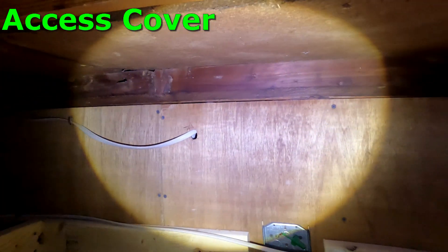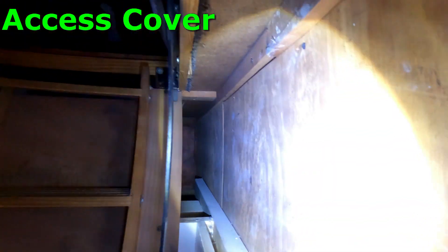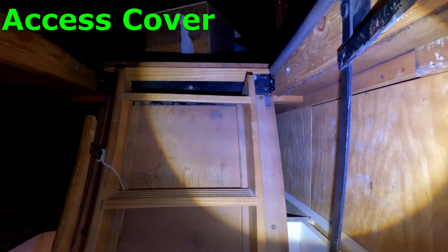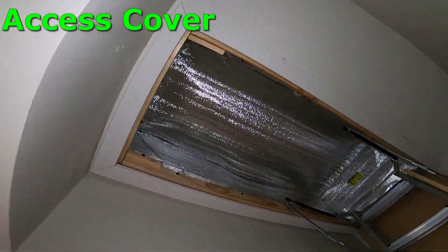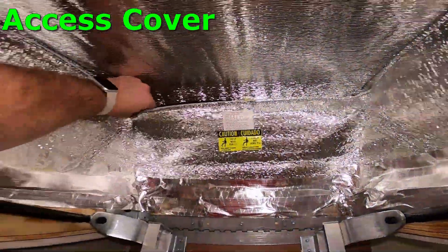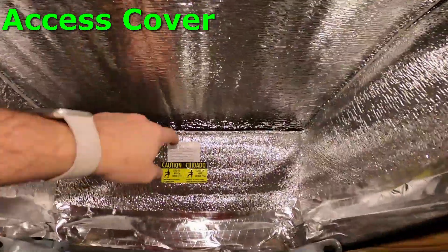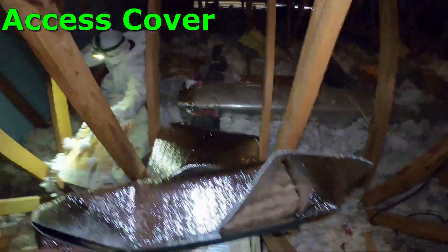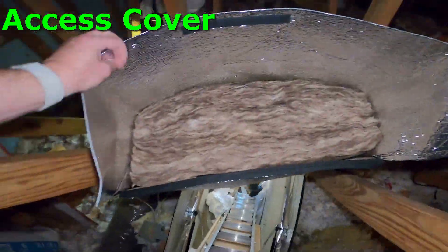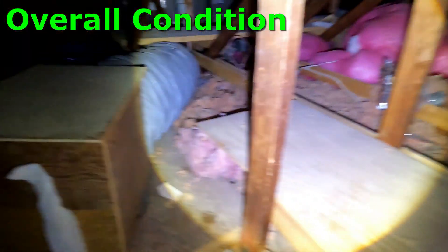This is definitely an interesting way that your hatch is set up. We kind of talked about that, but I wanted to show you how we would want to actually insulate and seal the pull-down stair. This is just an example of another one — the access cover that zips open. So when you do need to get up into the attic for any reason, you can just unzip it and buzz right up there. The nice thing is that over top it has a nice insulating layer, and when it's zipped closed it just creates a nice seal.